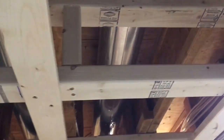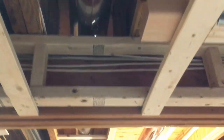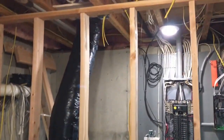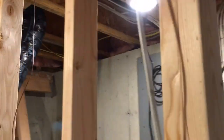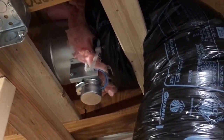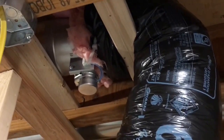For the last one, I tapped right in with a little starter collar. I chose to use stiff six-inch pipe so it wouldn't sag in the joists — it was easy enough to work with. After battling with all those collars and curves in the playroom area, I decided at the end here to use flex. At the very end I put this damper, and the thermostat will be on the adjacent wall to my left. The transformer is right next to it, so this run will be nice and easy.